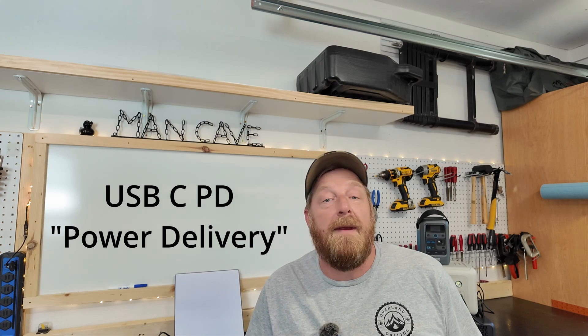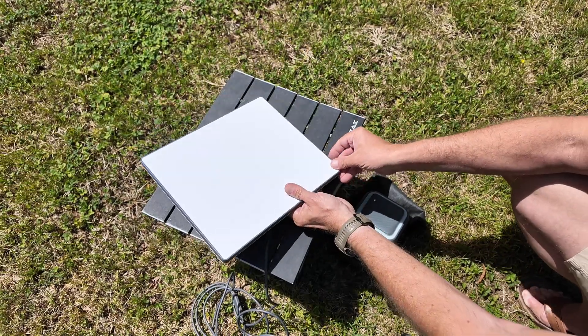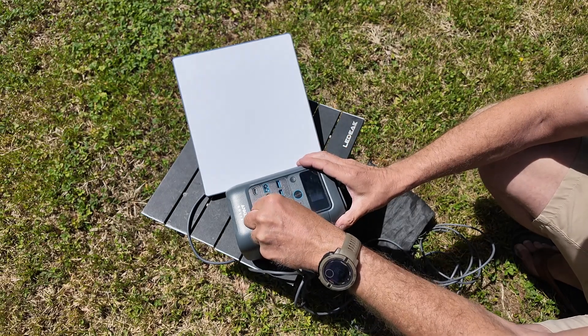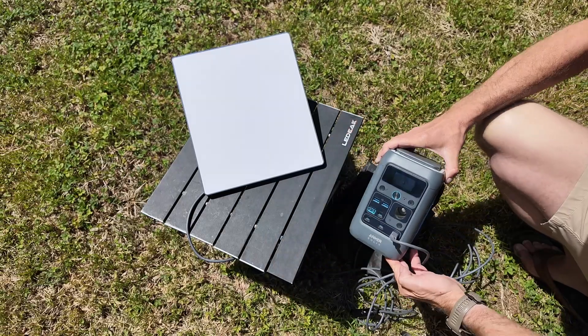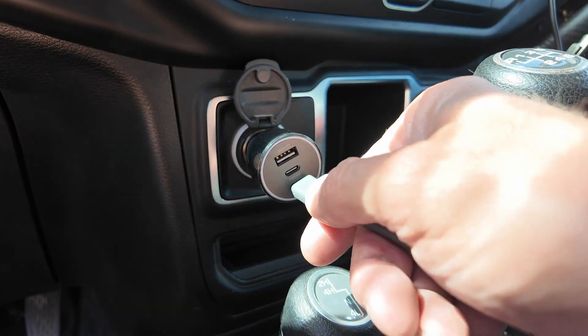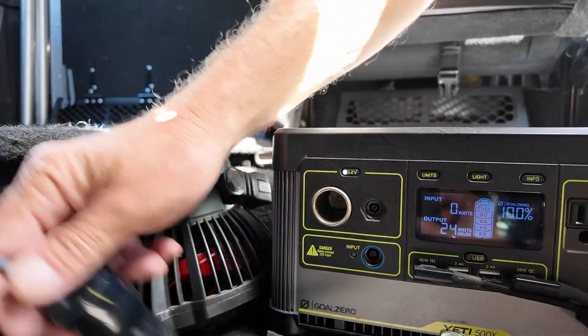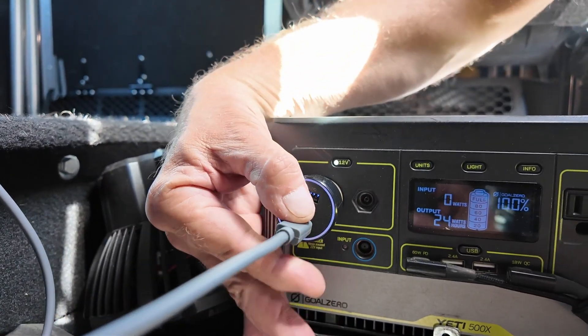I found a three-in-one cord that I now use for pretty much everything. For USB-C, it needs to be 100-watt PD — that stands for power delivery — and it needs to deliver 20 volts at 5 amps. Using a five-foot adapter cord plus the standard cable, it went over 55 feet. I like this method because it's simple and my power stations already have the USB-C PD plugs. The downside is I don't have a good way to waterproof things at the power connection points. Next up is the 12-volt USB-C cigarette lighter adapter — this is the option I first used to draw power from my vehicle while driving. It converts the 12-volt input and has a USB-C PD power output, and it's also handy if you've got older power stations that don't have PD capability.